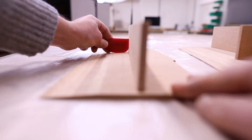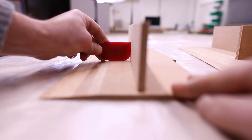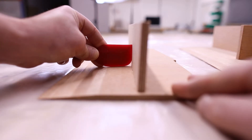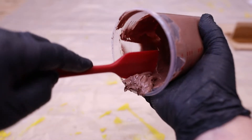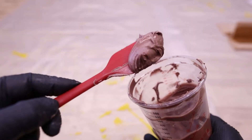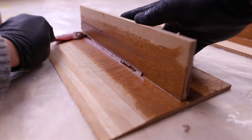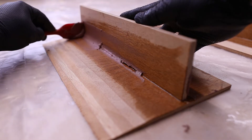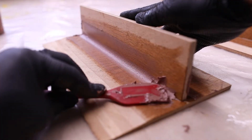When you run down an edge, you've not just got the shape of your fillet but also the blade of the spatula running 90 degrees either direction up the surface you're filleting. That means you've got nice control over the two faces where you normally get tram lines when using a mixing stick or filleting ball. So this tool is effectively a three-in-one: it loads your epoxy into the joint, creates your rounded fillet, and cleans up your faces where you normally get that tram lining.